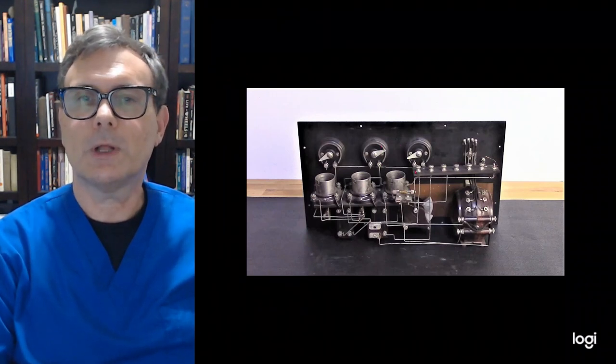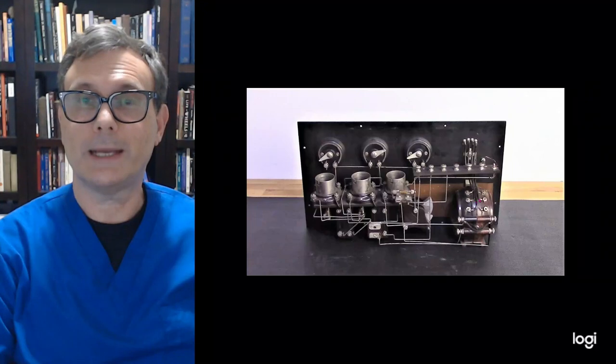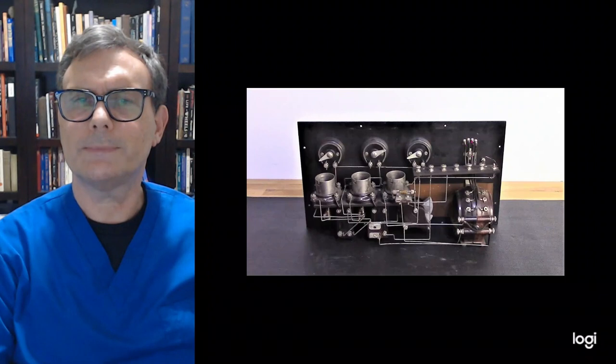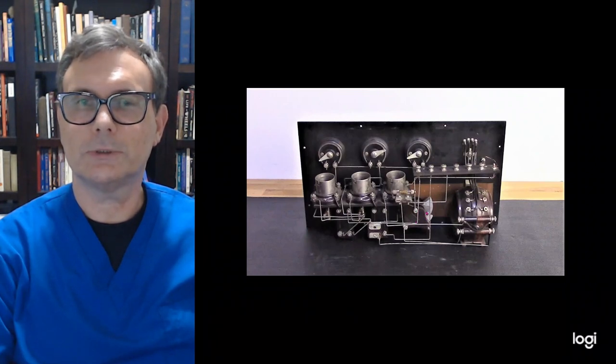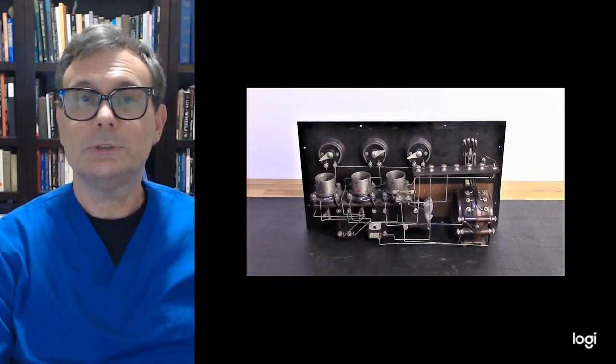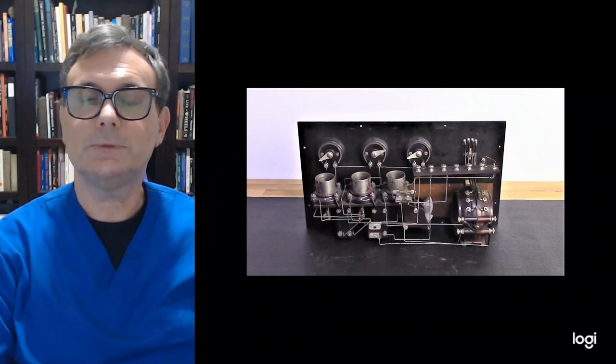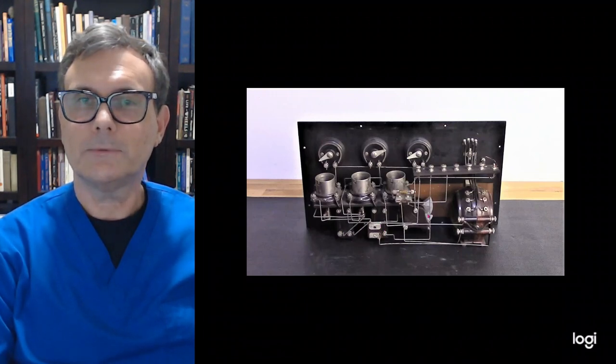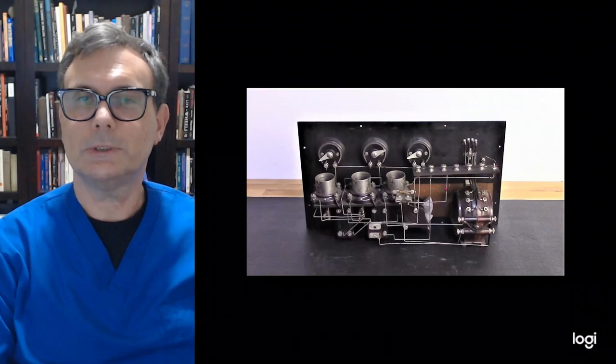Now, some of the other high-quality components include the Model 90 variocoupler. Unfortunately, they only use 4 of the taps. I don't know why there's 6 available, but whatever. There's also a Model 12 condenser used here, which has the vernier adjustment. This variocoupler also has vernier, by the way. It's using those real nice Model 60 tube sockets, and you also have the two Model 50 transformers here. So a lot of real high quality components are used in this particular design.